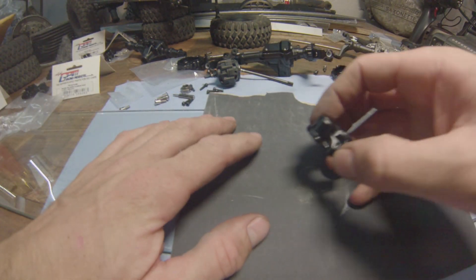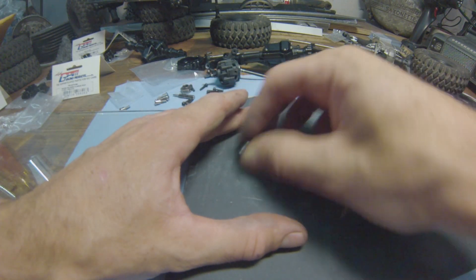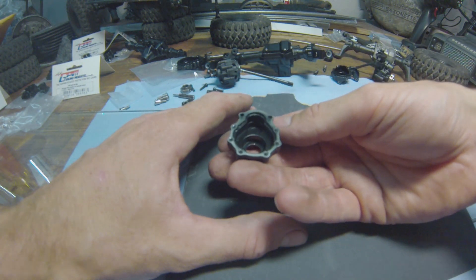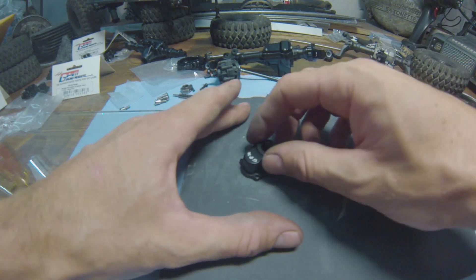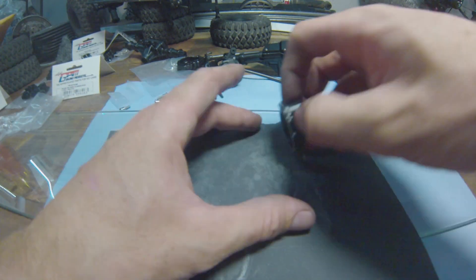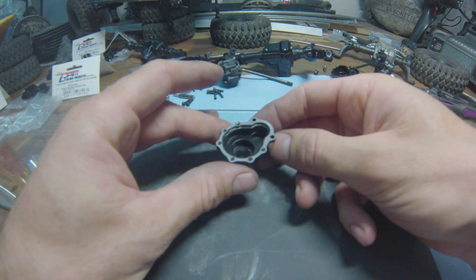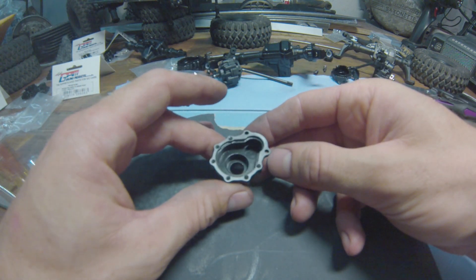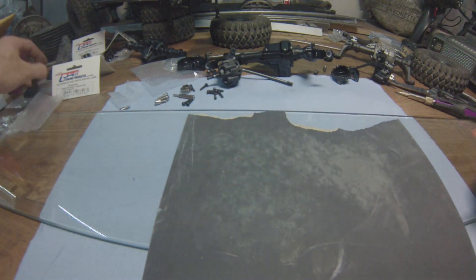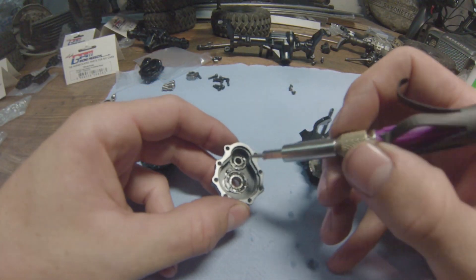Since the surface is glass it's completely flat, so the sandpaper sands down the mating face equally. And there you go — much better. I'll go right ahead and do the others.